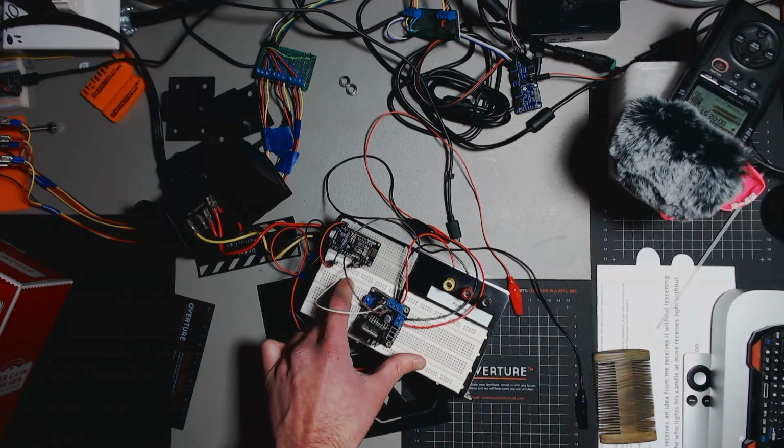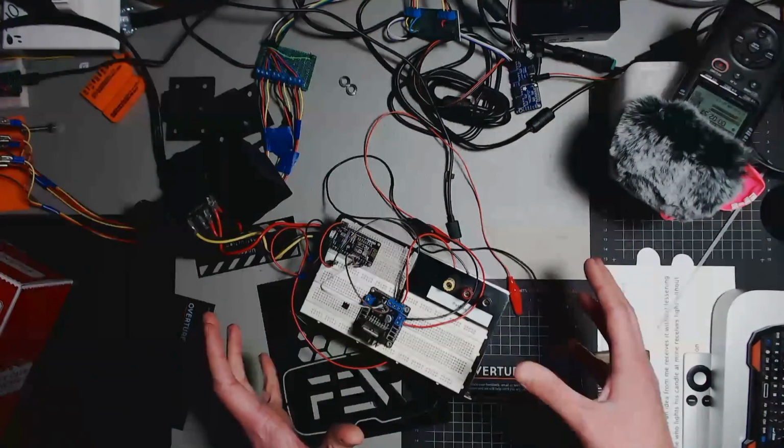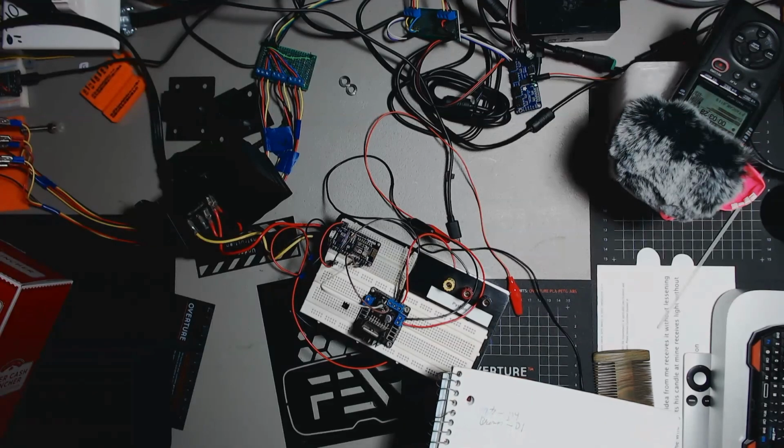So basically, ESP receives its data, throws it through, enables the motor, motor turns on, and fires at maximum speed, which is 12 volts. Come to find out this motor works fine at 12 volts. Don't know why they're running it at 5, roughly. Wait. Each battery is at 1.5 volts times 3. Alright, 4.5 volts. So, that's fine the way it is.